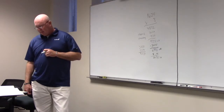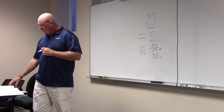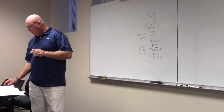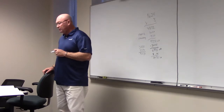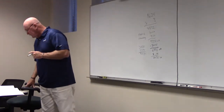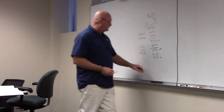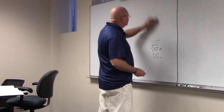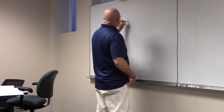5,230. All right. Step three says determine the range load. So we got to turn to Table 220 what? 55. To determine the range load, which is on page 72 if you got a 2014 code book. But it says it's 12 kW. All right, so in saying that, I'm gonna pull this off to the side. I'm gonna erase all this, but I need to remember it's 5,230, don't I? So I'm gonna write this off to the side. I'm just gonna write this down for now.